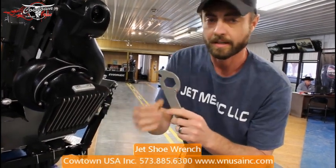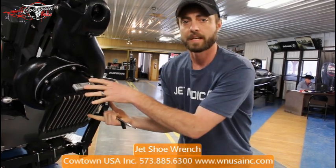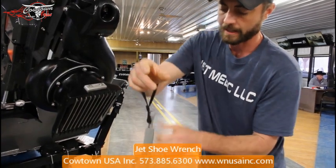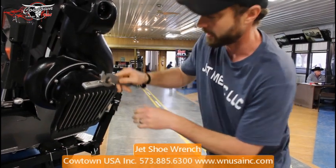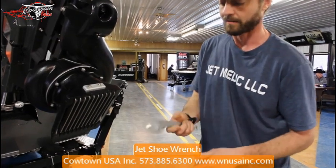Then this section here will grab your shaft nut. You can spin the shaft nut off, and now you can take your whole assembly out, reshim it, move the stuff out of the way, put it all back together with the same functions. And before you even get started, go ahead and put your lanyard on and cinch it up so that if you're doing this on the riverbank, you don't end up dropping it in the water and losing it.